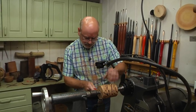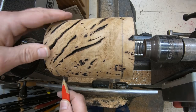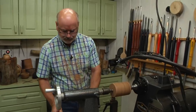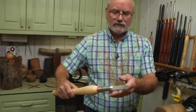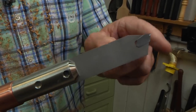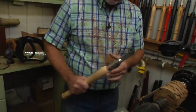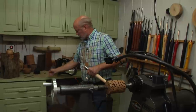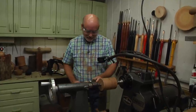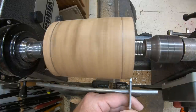We're going to part it down to that side, so I need to get my marks on here. Easy Wood has come out with a new parting tool — same process as before with a carbide tip, but now this whole piece comes out, so you don't have to worry about it falling out. You replace this whole piece really easily. I like it a lot. I just want to part this off on the ends and get the cylinder the same length as the width.